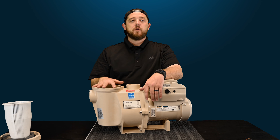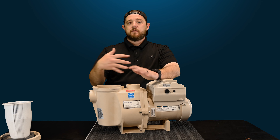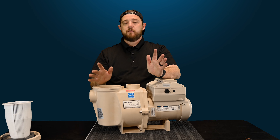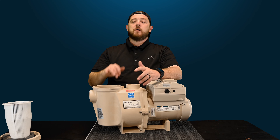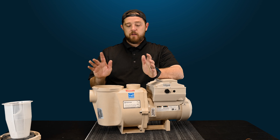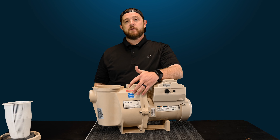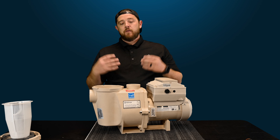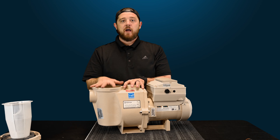This doesn't normally happen for us out here on the west side of the country. In the southwest, we don't ever shut our pools down because the weather never gets cold enough where you really need to worry about winterizing. But for those of you in the northeast or even in the middle of the country, you guys normally will get weather where you'll need to remove these drain plugs and drain everything out of here so you don't have the water contracting and expanding and breaking this plastic.